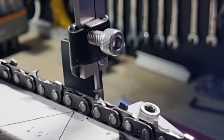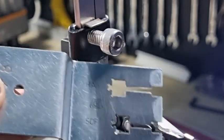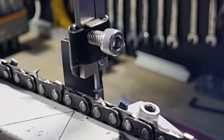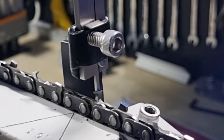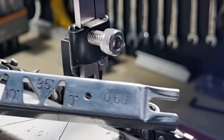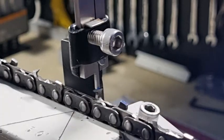So really to conclude — if you buy one of these raker gauges, you'll find out that you'll get a reasonably good attack angle, not optimal, but nonetheless it'll still be a very good attack angle and you will have no problems with your chainsaw. If you were to buy one of these depth gauges, it will work okay in the beginning, but you'll find out that your cutting performance will definitely drop off very badly when you start to get halfway to the end of the life of the chain. If you use the Husqvarna depth type gauges, you'll find out it will work reasonably good, but it will not be as aggressive as the Stihl.